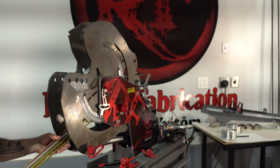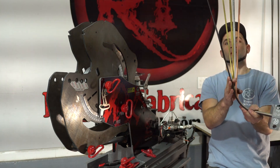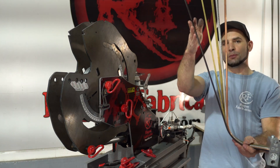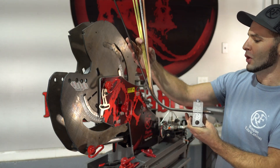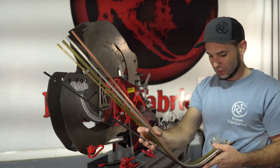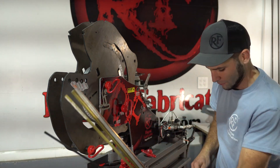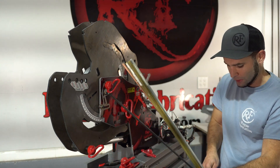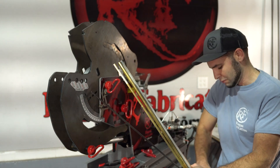This is an interesting demonstration on spring back variety. You can see that the 1144 stress-proof rod has the most spring back by far — that's the dark one in my right hand, left on your side. It sprung back a lot more than the others, but that is all five of them bent at the same time. Of course we can adjust and bend them again. You have to clamp pretty tight to get all five to bend at once since they've got different tolerances and different hardnesses, but it can be done.